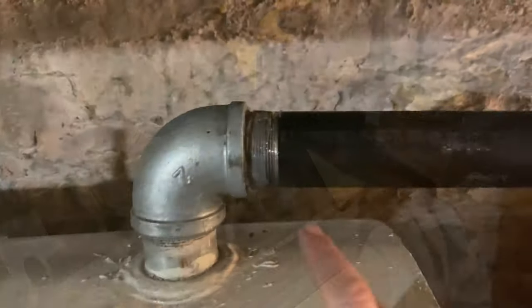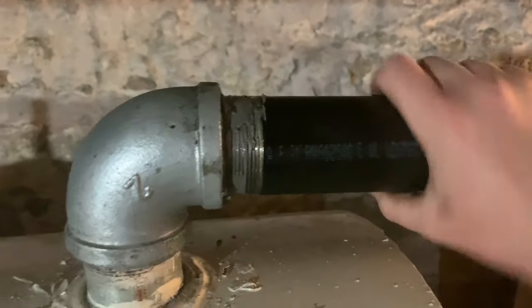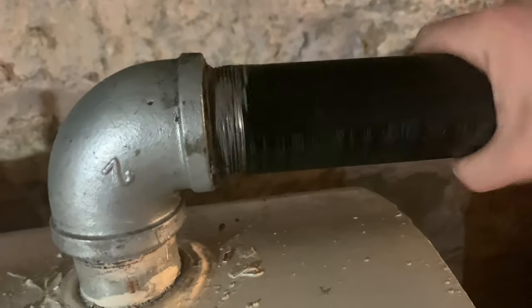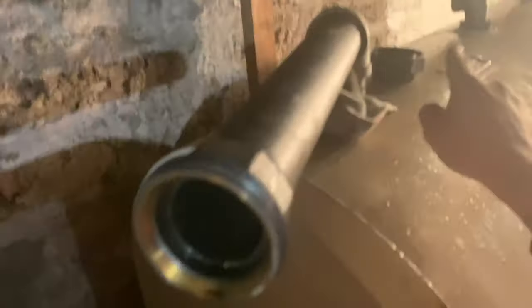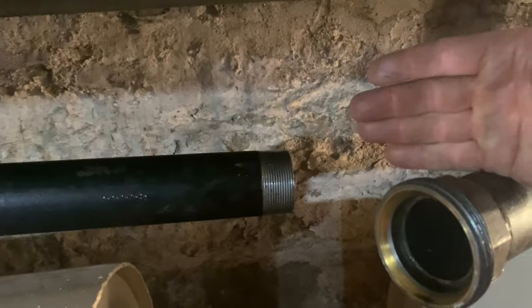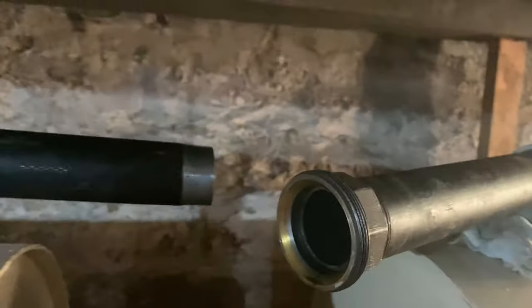Okay, just like the other pipes, we have this 2-inch nipple all pipe doped up and going in here. What we're gonna do is we're gonna tighten this side here first. Once we get this here tight, we're gonna put our other piece of our union down there on this side, bring these both out. And the idea behind the theory is to join these together and then screw our collar from our three-piece union, our first, second, and our third piece on, and this should join together and kind of even out. So I'm gonna go ahead and get that on.